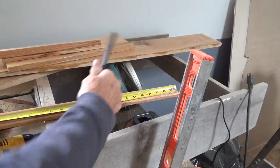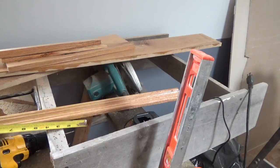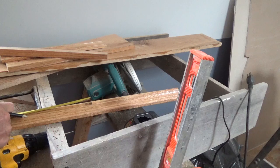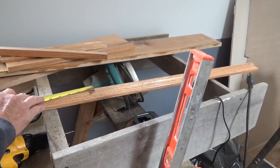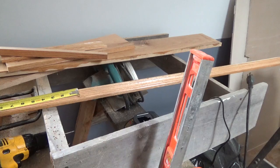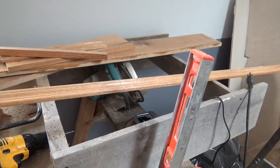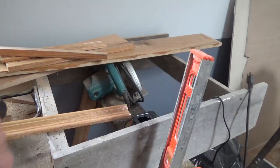I'm going to take this piece of molding and measure and put a little tick mark where I want the drill marks to be. There's going to be one at 11 inches, and then every 16 from that. Rather than adding 11 to 16 each time, I move the tape measure over and just measure every 16. That way I know I'm not wrong and I'm not trying to add in my head — I'm almost always distracted by something, whether it's my own thinking or Bullseye down there. So I mark all the marks and then drill holes where the nails are going to go, starting at 11 inches.